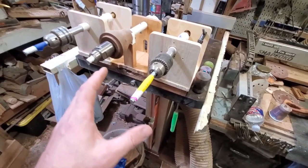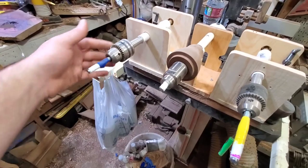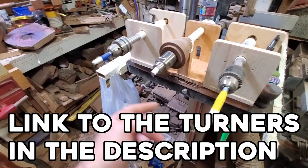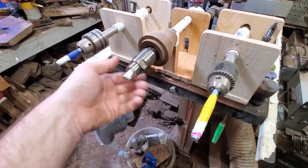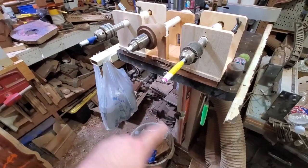All right, we're back. I'm ready to go inside. Before I do, I'm going to put the resin finish on a couple of these bottle stoppers. All I have here are modified cup turners — I just cut that and shoved in a Jacob's chuck. This is your standard MT2 taper with a three-eighths 16 bolt. This one's a little bit different, but it's a one-inch 8 threaded rod and I just throw it on my mandrel. Very important — you put the Teflon tape on. I'm going to do that now on the ones that need it.